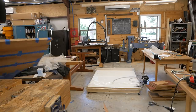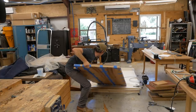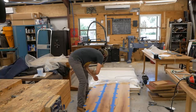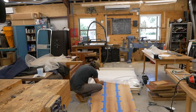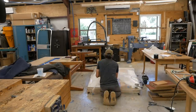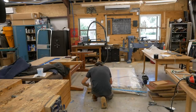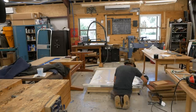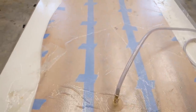Getting it in the bag on your own is tough — I actually tore the corner of the veneer trying to do it. I said a few bad words that I cut out. Mistakes happen, but luckily this is rustic wood so we can repair it and glue it back on. This is the breather mesh I'm putting in — it allows the air to escape and go around the panel. And that does it for the first video. We basically laid up the veneer for the headboard. On the next video we'll cut some joinery, get it all put together, and do the applied trim, which is the tricky part. Stay tuned, check out the next video, and leave a comment to let me know what you think.